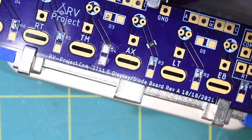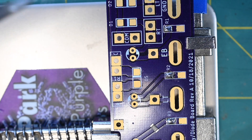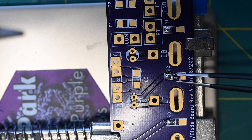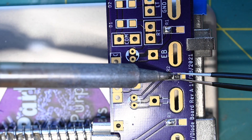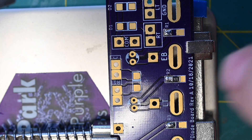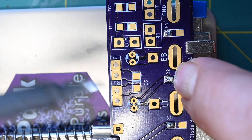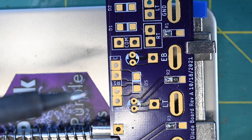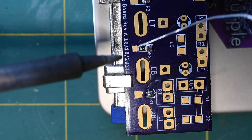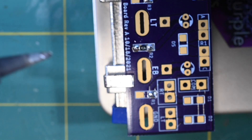I like to orient the board a little bit better. We're going to solder resistor R2 right here. I did put a little blob of solder on one pad, with no solder on the other side. Then I position the SMD component and tack it in place. I take my fingernail, push down on the center of the component, and tack it again — you may hear it snap, which flattens it in place. Then rotate the board 180 degrees and solder the other side. And that's all there is to it.